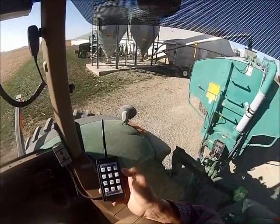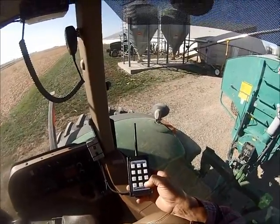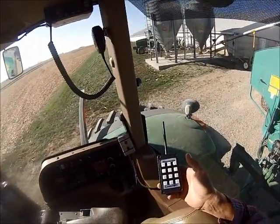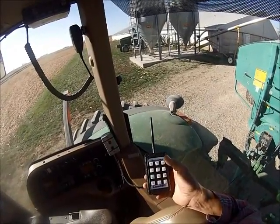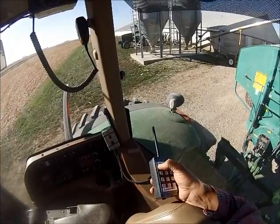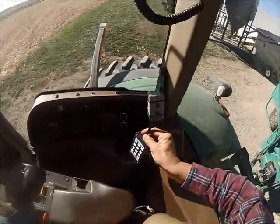Now that our tank is full, we're just going to throttle back — auto down — and stick the throttle back to idle. We're going to hit the valve close, and it's going to go through an automatic shut and an 8 second cycle to make positive the valve is closed. And then we're just going to agitate on low, which just brings the throttle up just a little, and we're off.